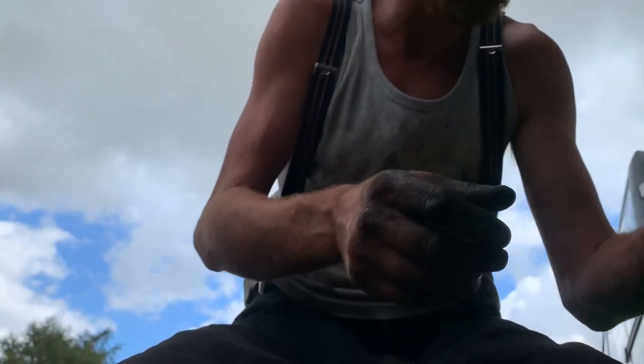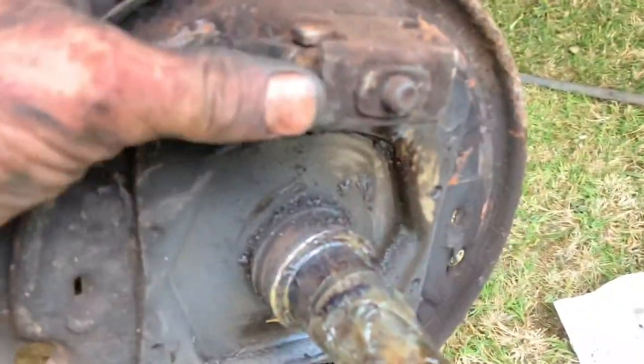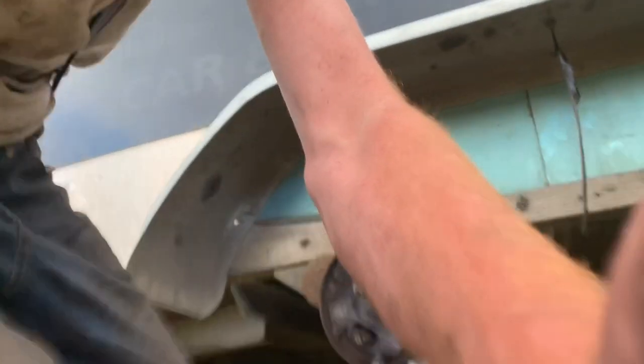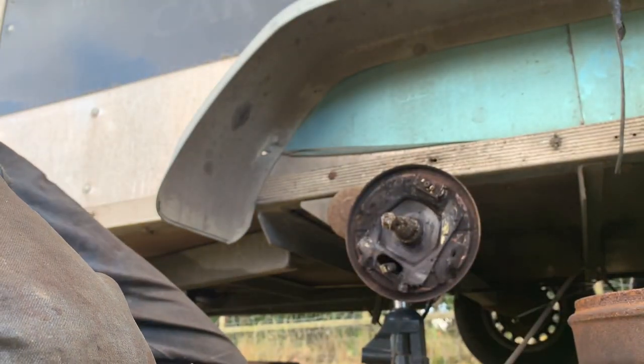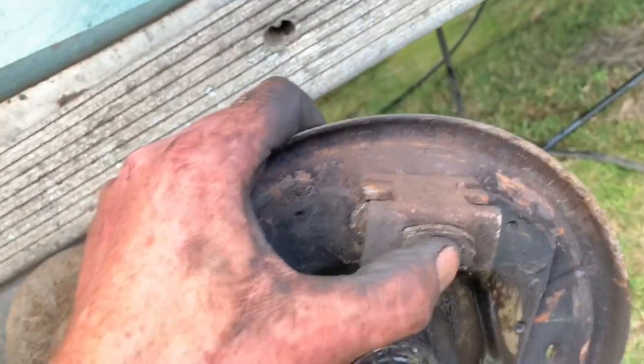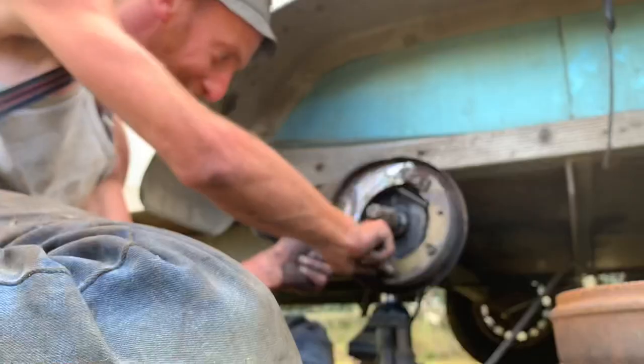If I slacken that bolt, she's a noisy one. She's talking to Turkey Tom. My girl, what are you doing? But I'll slacken that off there, look, which should allow them two wedges to go further in. That's an idea. Let's do it. Our bird is talking to us. There you are, look. That's another, that's for the top adjustment of the shoe. That's it then. Pull it all back together. It'll go on now.